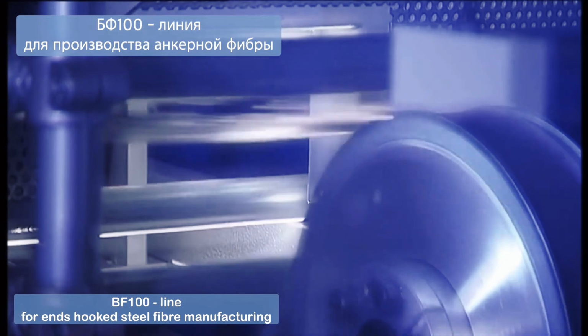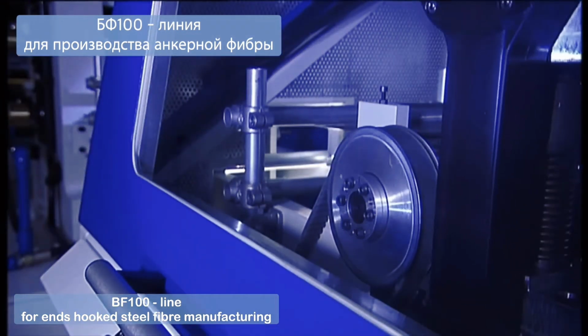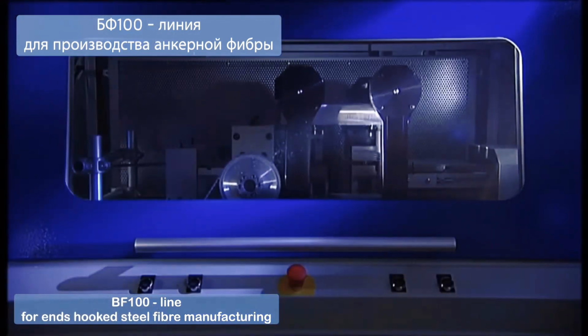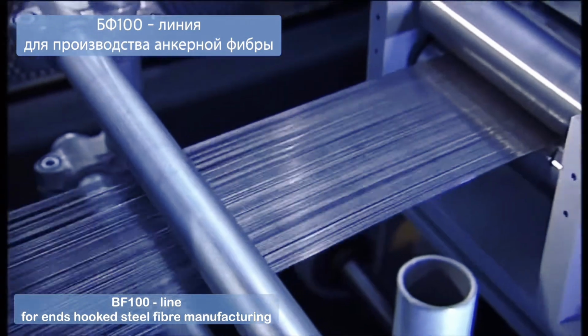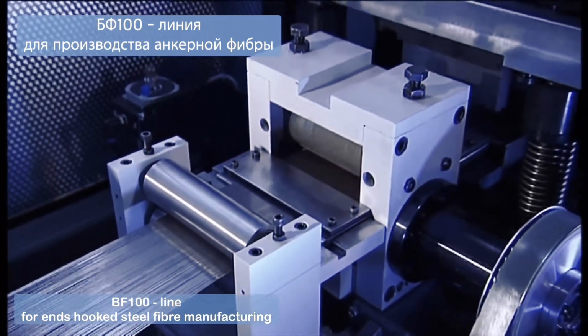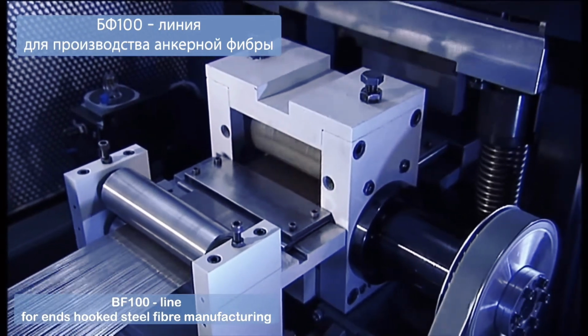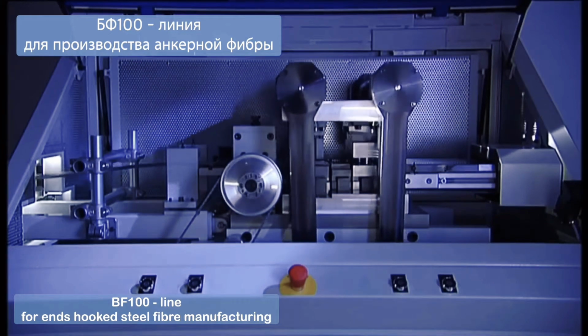The auxiliary feeder pushes the wires into the tool of the punching machine in a synchronized manner. The wire feed-in length is directly entered in the control unit and implemented precisely by the servo motor of the feeder. Wire guides prevent the wires from buckling and ensure fault-free operation.